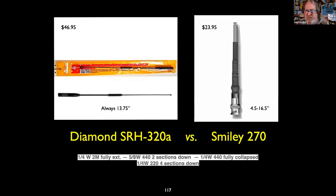Improve your stock antenna — we all know they're negative 3, negative 5, negative 8 dB gain at best. For 2-meter receive, the Diamond SRH320 is a wonderful antenna — always 14 inches long, close to $50. A better performer at half the cost is the Smiley 270, a collapsible metal whip. It's got a beefy coil in the base that protects your handheld's antenna connector. Fully extended, it's a quarter-wave 2-meter antenna outperforming antennas at twice the price.